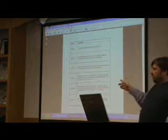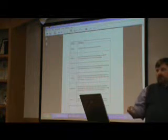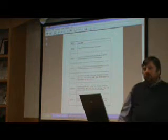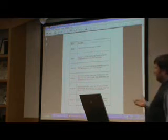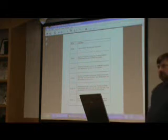You see, 3R is rain tight. It's protected from rain falling down. So you couldn't spray a hose at a 3R panel because there's a possibility water could go up and get into something. Type 1 is just basically protection from you can't stick your fingers in the live components when the door is closed. So.